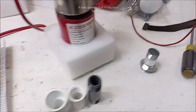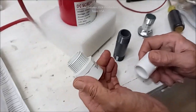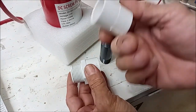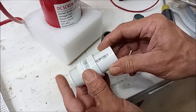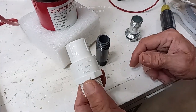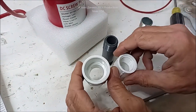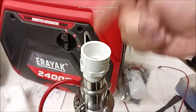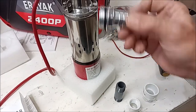Here's the solution. You're going to get a one-inch male adapter — one-inch socket, one-inch male on that side. Then you're going to get a three-quarter reduction. These are Lasco, but Nibco and other companies — Charlotte Pipe — they all make about the same. You see that? I can glue those two together. This glues into here. Now you're like, 'But John, I want to pump one-inch water.' Okay, well here's the problem with that — these pumps, DC pumps, one inch of water is as dumb as a box of rocks. That's how you make them go bad; that little motor will go bad.